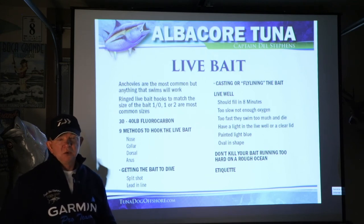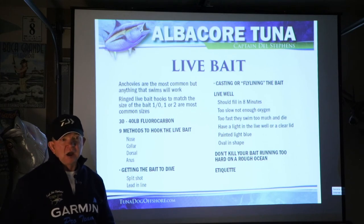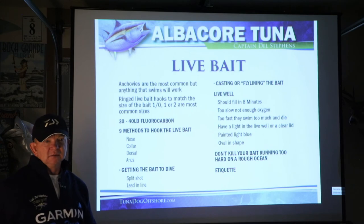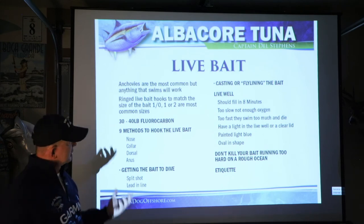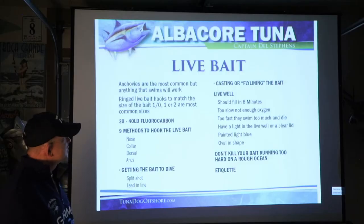Many times they're where the water comes in and they'll have a way to unsnap them so you can get in and clean them out. They have a valve on them so you can shut them off so that way the water doesn't flow in while you're trying to do all that and the boat starts sinking. But a sea chest helps with that. But you can make a sea chest. Most of them are made out of stainless steel and have a clear plastic top to them. But pretty easy to make.